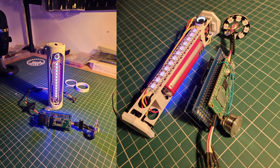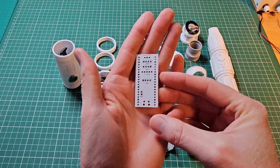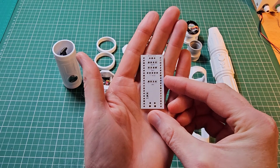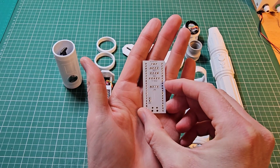Once I assembled this wiring I found that everything worked as expected with a few tweaks. The problem was that this wiring was difficult to reproduce and I wanted others to be able to follow this build themselves, so I jumped into KiCad and designed a PCB. This new PCB included all of the connectors so that the modules could be soldered in place without complicated wiring. I also included headers to connect the same magnetic connectors to the complete board.